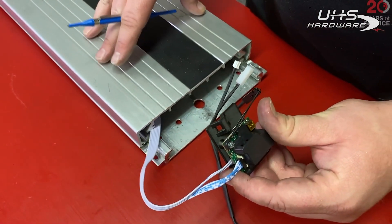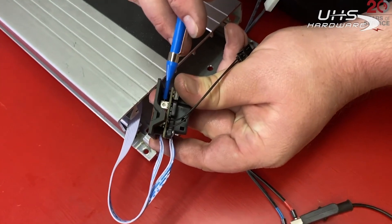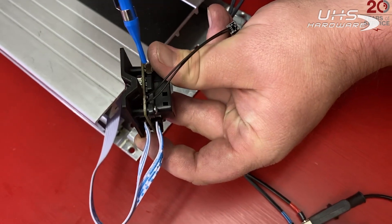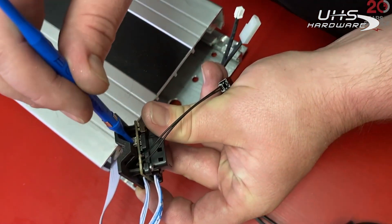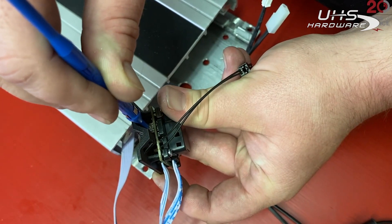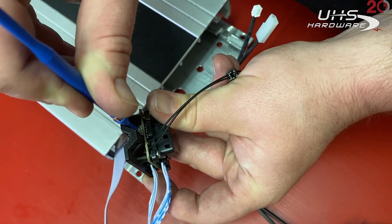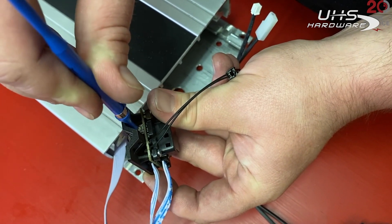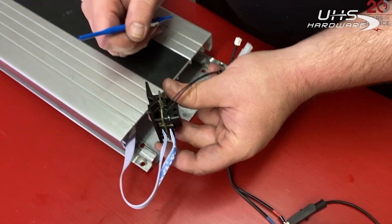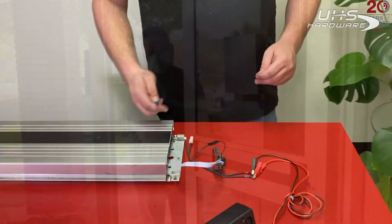The alternative method uses a trim pot on the underside of the MM4. To increase the amount the device pulls in, rotate it clockwise; to decrease it, adjust counterclockwise. Please note: once you start dialing in the potentiometer, the push-to-set will be shunted until the potentiometer is turned all the way counterclockwise to zero.